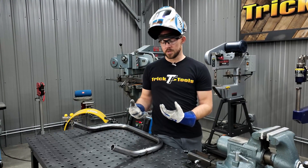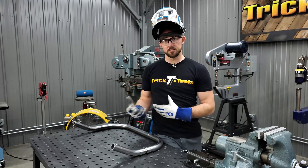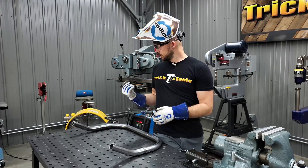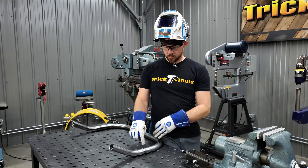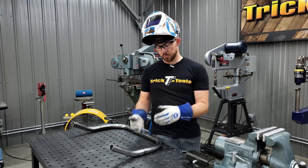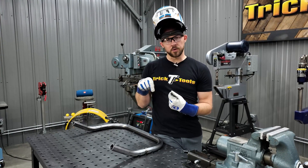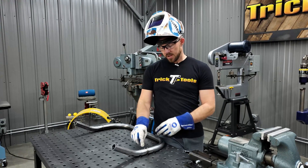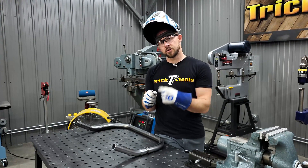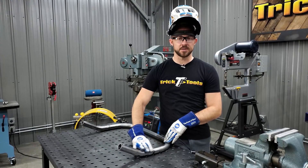If I was MIG welding these I would have made these holes a little bigger, because of the way MIG welding works as opposed to TIG welding. With TIG welding, I'm going to take the torch and actually melt the original metal on the tube around the hole, making sure it's melted and joined with the slug on the inside of the tube before I even add any rod into the weld. I'll go around the hole, get the puddle started, and once the slug on the inside and the original tube are melted together, then I'll add rod to fill up the hole and make it strong.